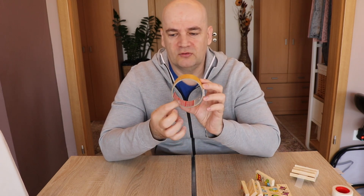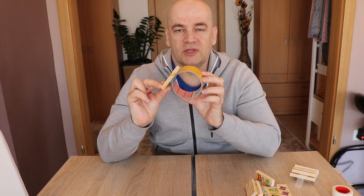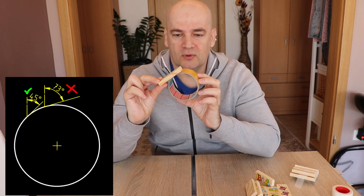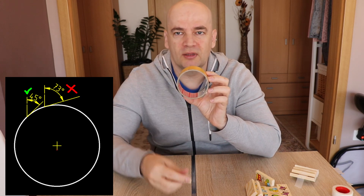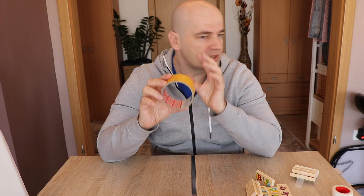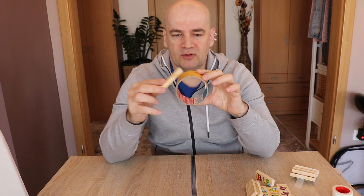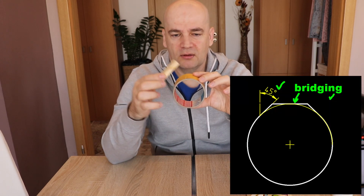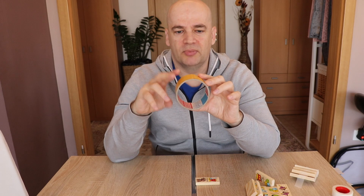Another example: imagine that you want to print a vertical hole. At the start there is no problem, but at this point we have a 45 degree overhang, and above this, theoretically at the top it is a 90 degree overhang, so this cannot be printed. With small holes that can be okay, but with bigger holes it will not work. What we can do is after 45 degrees, continue with a straight line and end there, so a rod or shaft can be placed in this hole.